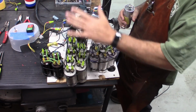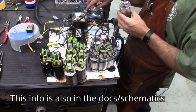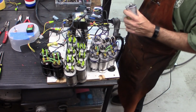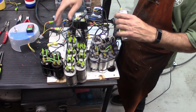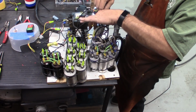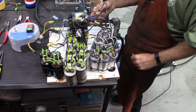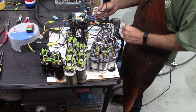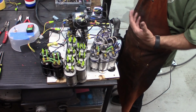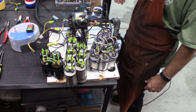And then finally, part of the circuit, you actually run a capacitor across your two powered legs in order to bring the running amp of the motor down a little bit. And it doesn't take a lot, so I just have one capacitor that runs on there. You just clamp an amp meter on one of these lines, add a capacitor, see what it does, juggle it up and down, try to get that amperage to come down just a little bit.